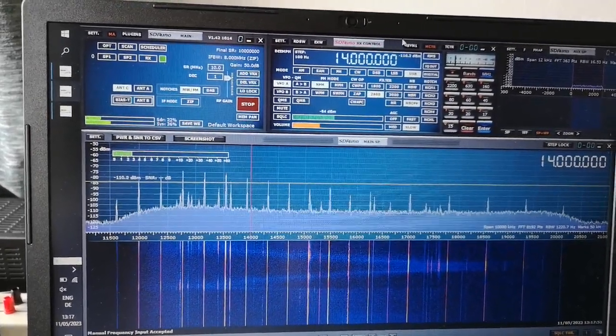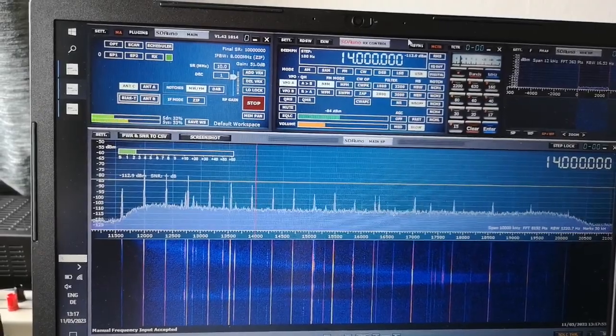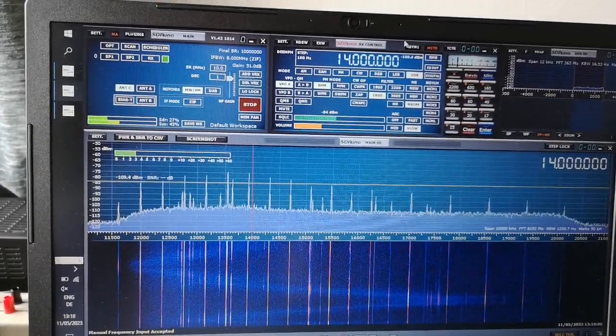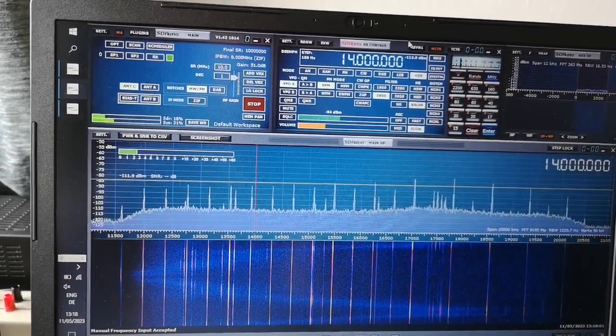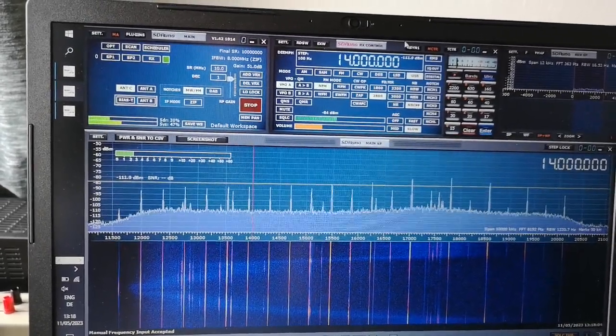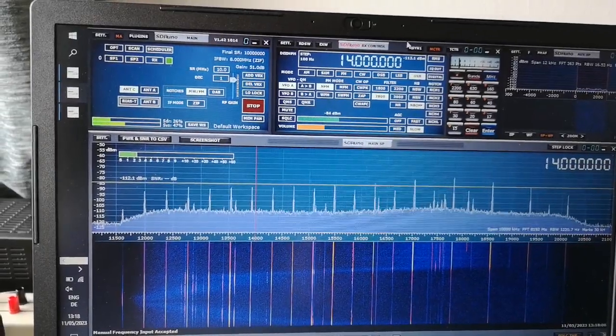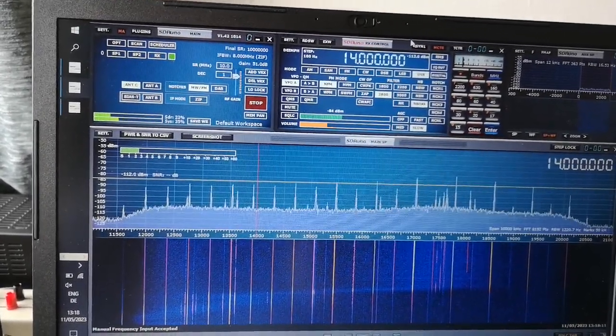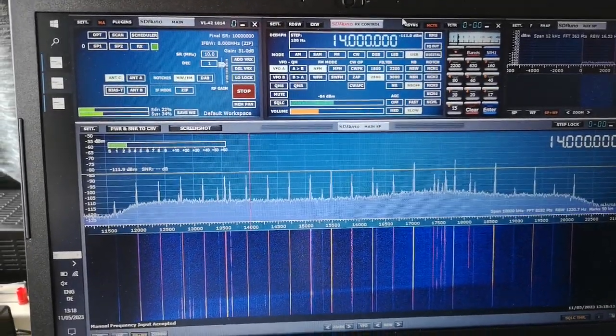I hope you can see that. It's down at 10, 11 megahertz, and then moving slowly back up, there's 14 megahertz. And it seems to go as far as about 17, 18 megahertz at the moment. Which is interesting because this loop does actually work up to 50 megahertz. I've tested it, some kind of a secondary resonance effect.